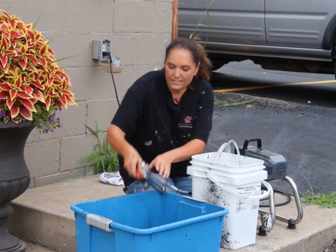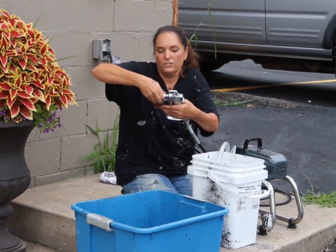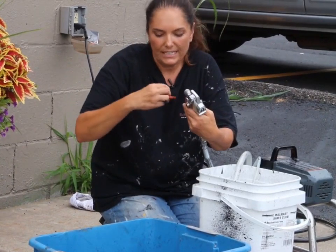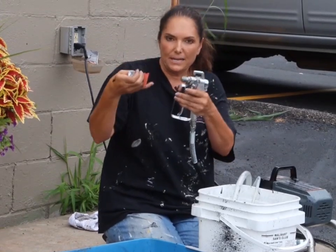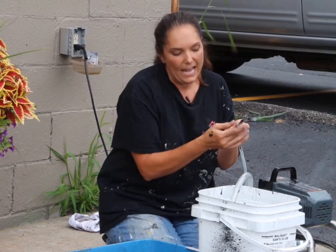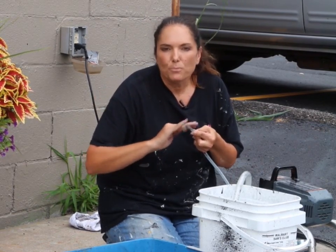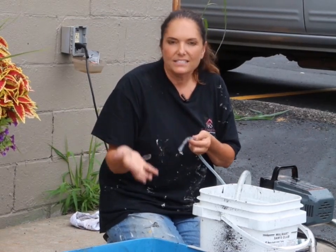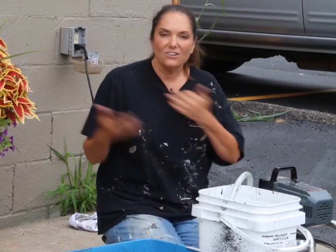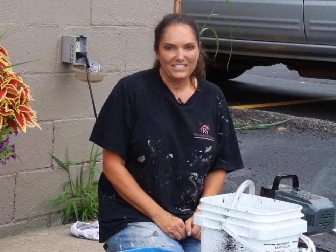I turn it off — the whole thing is clean. I unhook the nozzle, just unscrewing it like I showed in the first video, and store it separately. The only other thing I like to do is clean any paint off the outside of the tubes using a little green Scotch-Brite pad, just so that if I use white paint next time I don't get black flakes in it. That's all there is to it. Cleaning the machine is easy, getting the machine ready is easy, and painting is easy. I'm Leigh Ann Lee, your diva of DIY — see you next time.